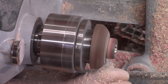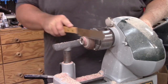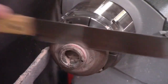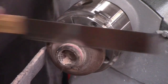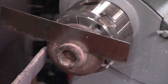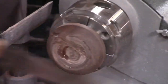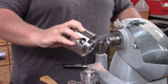If my blank was wide enough I could make another ring, but this was just enough for one. I use the flush cut saw to cut this off — cut about halfway through, then give a little bend to pop it. It'll either pop the glue off or take a little bit of the waste wood off, but it comes off really easily. The beauty is you can keep using the waste block by surfacing it and re-gluing your next piece on. This waste block has probably been used for 20 rings — it used to be much bigger.